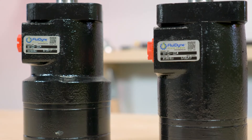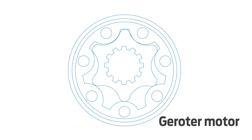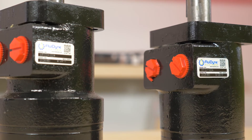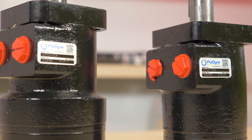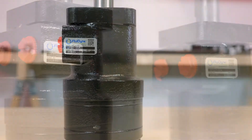So I'm sure you're asking, what's the difference? Essentially, a GearRoller has rolls added to the lobes of the outer ring of the orbit gear set. These rolls act like a roller bearing and reduce friction, increase mechanical efficiency, and reduce wear in systems with low fluid viscosity. The GearRoller type motors also typically feature smoother performance at low speed conditions. In fact, for applications running at less than 100 RPM, you should really consider using a GearRoller hydraulic motor.